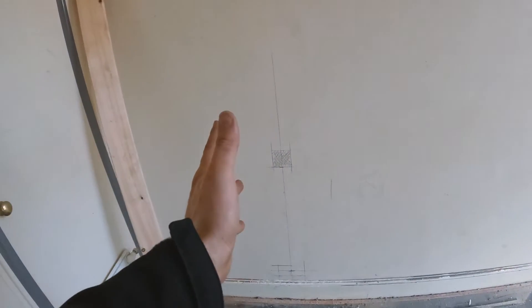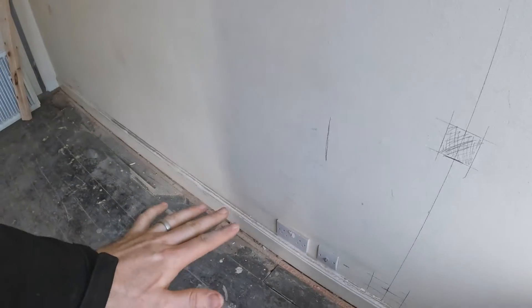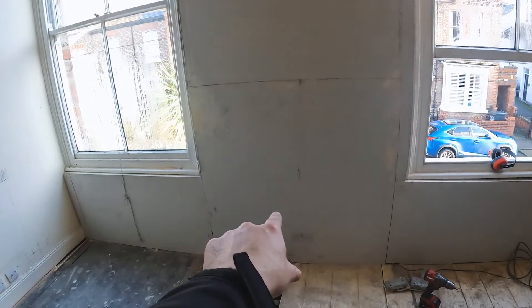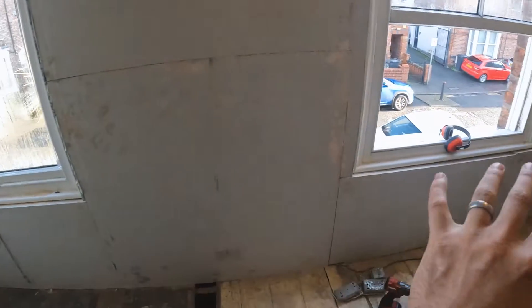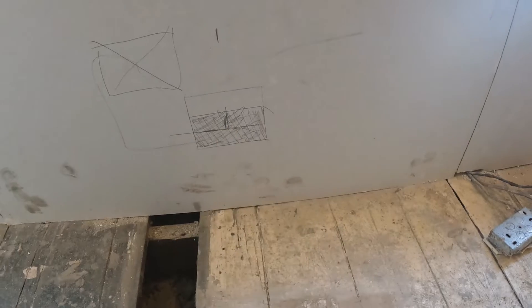Done the same for the other side of the bed — socket and a switch. Heights of the switches are at 800mm, so when you're in bed you can access it nice and easy. If it was at 1200mm you'd be reaching up. The cabinet will probably sit about 500-600mm, so they'll be able to reach the light switch nice and easy. This socket the builder put there — we've just moved it over slightly to centralise it between the two windows. So we're going to put a socket up there at the same height as the others.